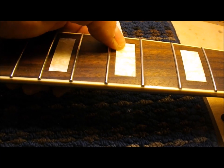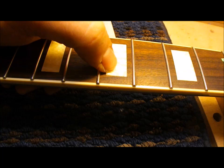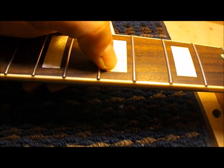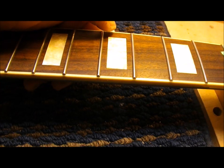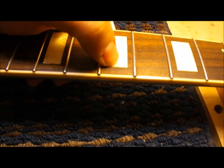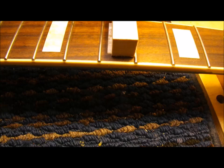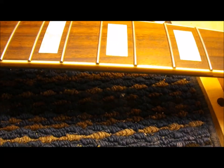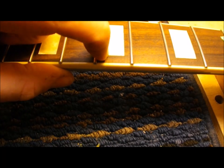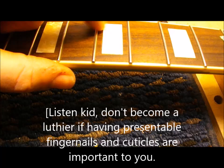This is a flat piece of plastic on a radiused surface, and I can't really pull it out to get glue underneath it. I'm going to use thin super glue and depend on the capillary action to pull it into the crevice. The problem is how do you get it to sit down all the way across? I can't use something flat, or my finger, and expect it to cover the entire contact point. So I might get this area glued down and still have a bit of a ridge on the rest of it.